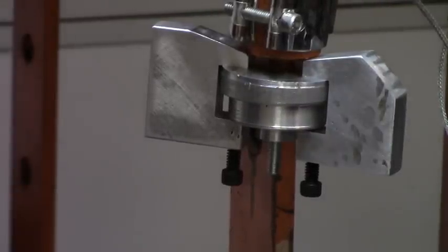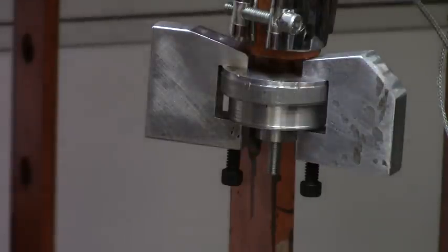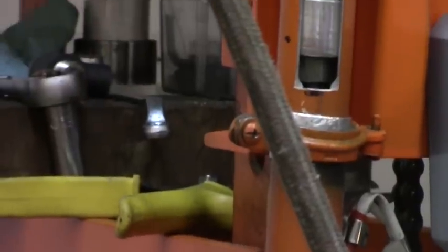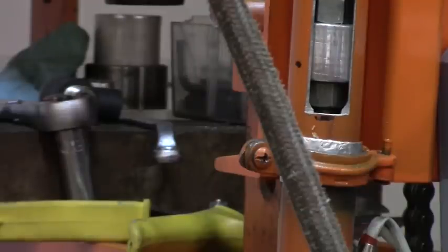All right, that's 150 pounds, around 125 pounds. I don't see anything coming out anywhere. I know the cylinder there's full of plastic because I've been stuffing in big, huge chunks. And there's how far the piston's gone down. That's the little support piece behind the piston that you're looking at. The rest of the piston has settled on down into the tube there on top of that hot plastic. And I may stroke it back up one time just to observe it.